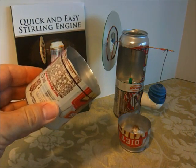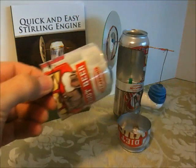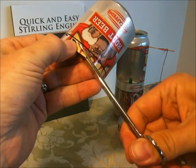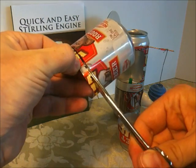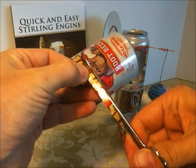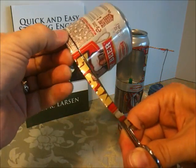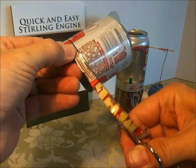If you try to put something like that together, it will actually split and tear where those jagged edges are. So in order to make it smooth, I'm going to use a slightly larger pair of scissors and cut very carefully down to the mark. I've turned the can around so for a right-handed person I'm cutting what feels like backwards, with the scrap on the left side — but as you can see, doing that makes the scrap turn up and come out of the way, which helps get a nice clean edge.